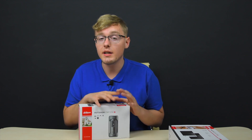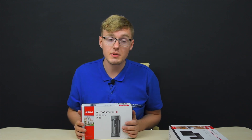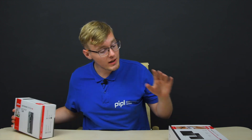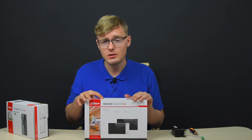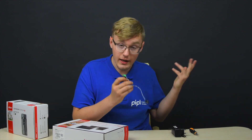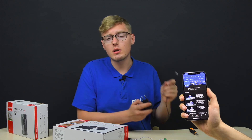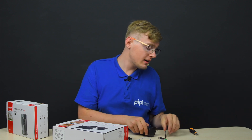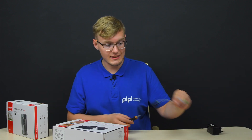The indoor station is IP network equipment and it has a PoE feature that I love for the simplicity of transmitting power and internet. But the monitor itself is not PoE type, so make sure to have the right connectors: two LAN cables, a PoE switch, a 20V power supply, and probably a knife to strip contact wires, plus a screwdriver.